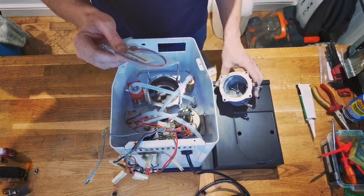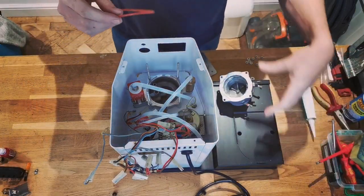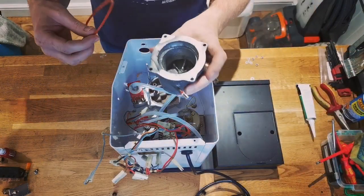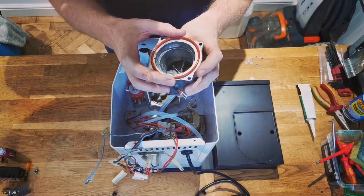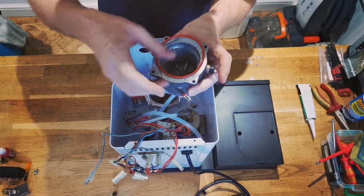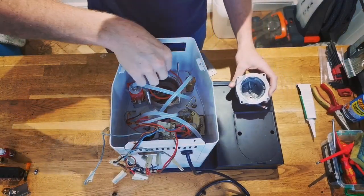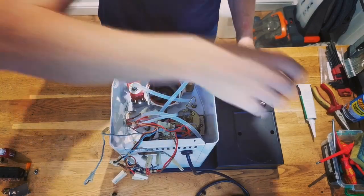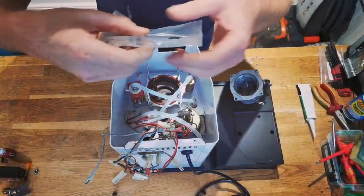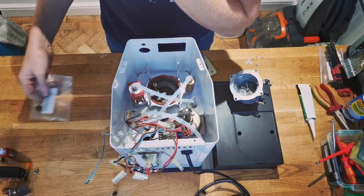It's as well known, obviously, these old Gaggia old white coffees as they're known. You can't get the replacement boilers anymore, so you can't get spare parts and things. So I measured the old silicone gasket and replaced it with the same size that fits in there. It's 85mm. I got it off Amazon. 85mm outside diameter and a 4mm cross section.